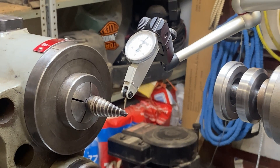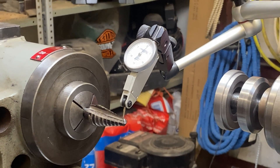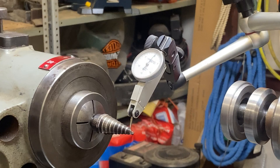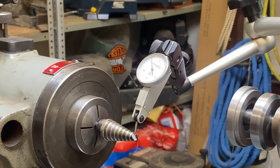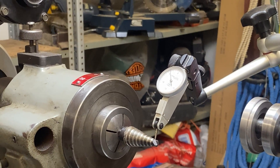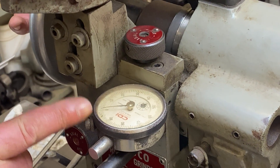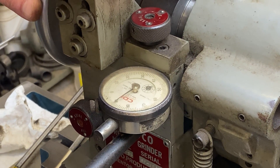Coming into it, hitting zero, it's coming around. I'm going to give it just a little more relief than it had — only by a thou. At the end it just drops off, so that's fine. There is our radial relief set. If you watch this dial you'll see that we're putting a total of 12 thou radial relief on this thing.